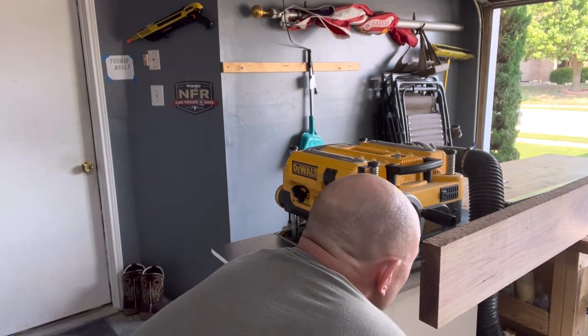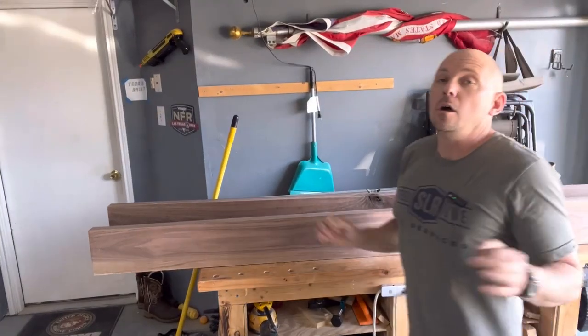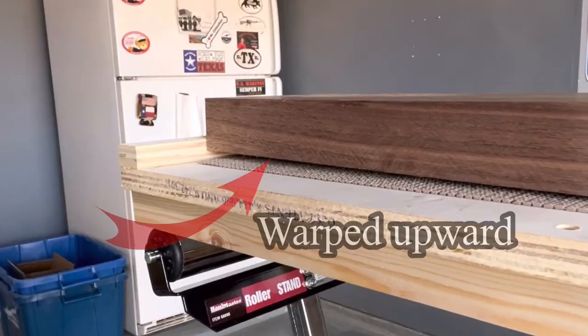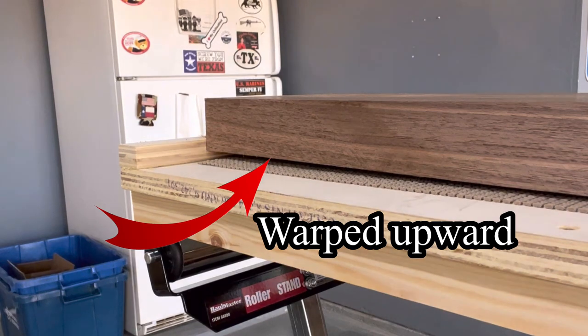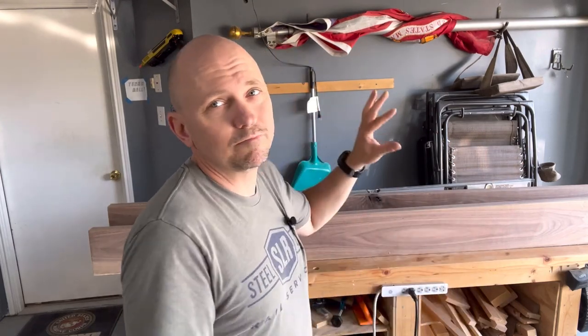From there I could look down and actually see how flat and true these boards really are. A little bit of a problem — these boards are a little bit warped and I've got to fix that. The sled I have for my planer to take out warp, because I don't have a jointer, is not long enough to accommodate an eight-foot board. So this is where this video kind of splits into two videos. I'll show it quickly here on the sled, but there will be another video where I show how I built the sled, how I shim it, and all that to get a nice flat surface.